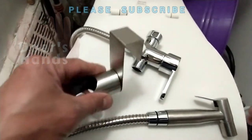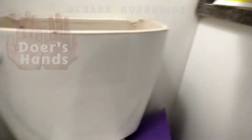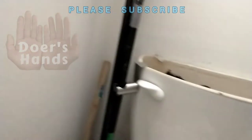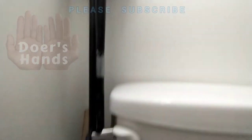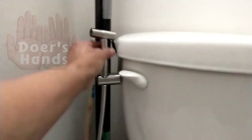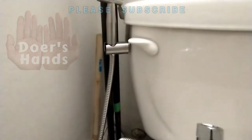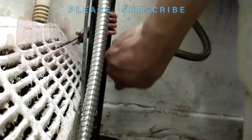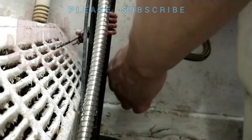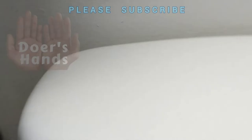Next is we will put this hanger for the bidet handle to this container of the flush. Bidet gun sprayer, you just shoot it there. Easy. And we will put this now under here. Next is we will shut off this valve. Make sure there's no water will flow to this hose. So we'll flush it. There's no water.